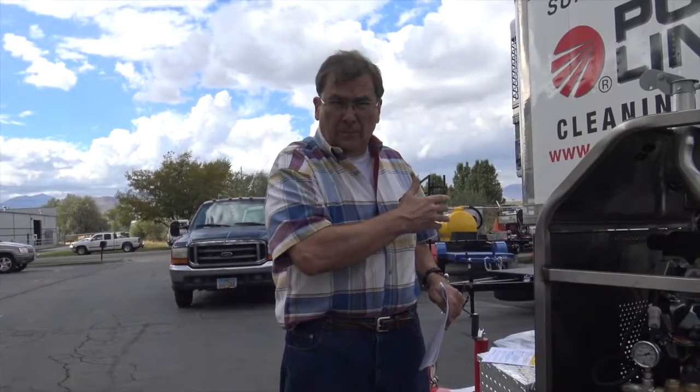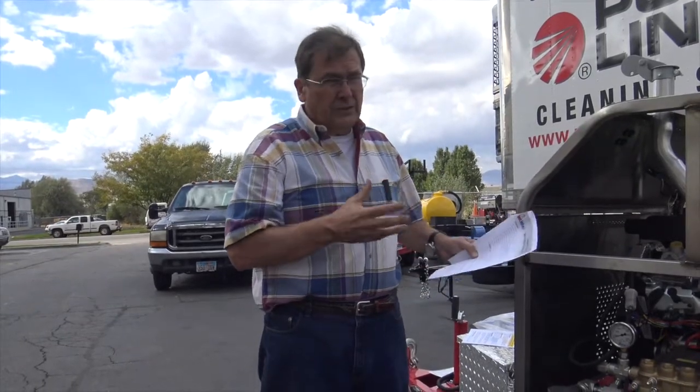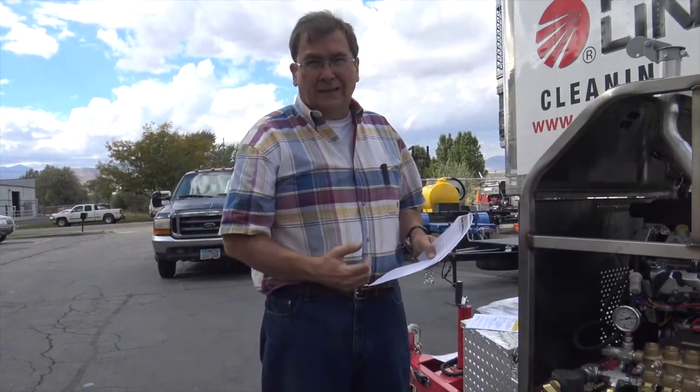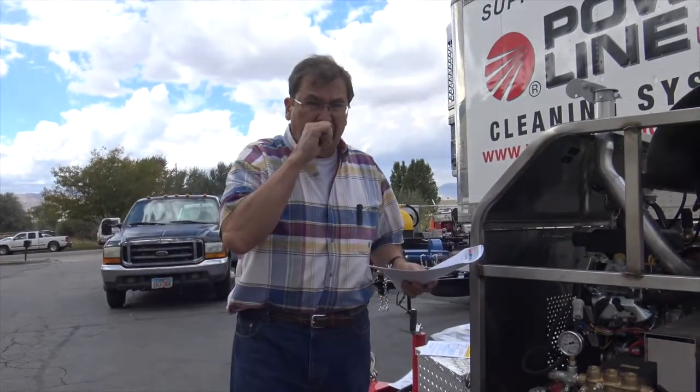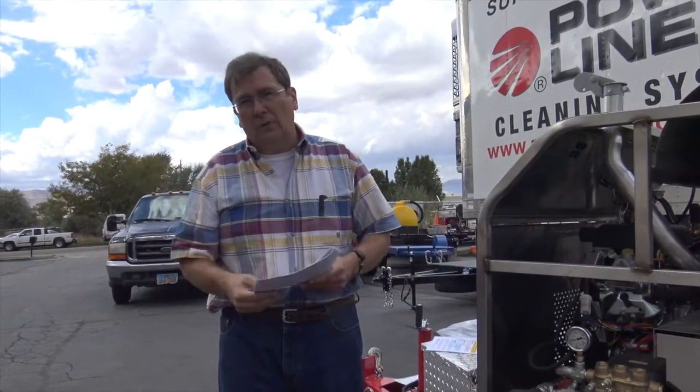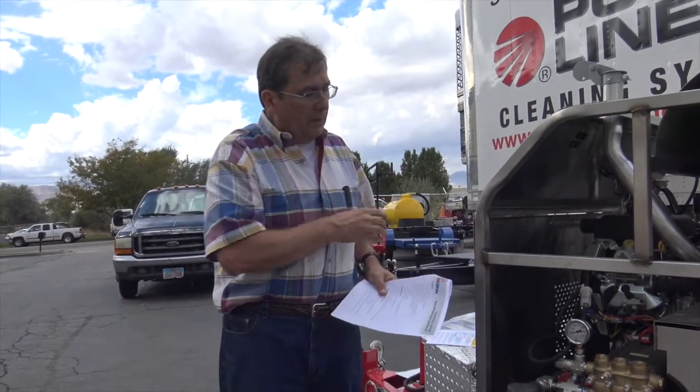It's got break-in oil. You have to change it between 5 and 10 hours, and I'd use Mobil 1. Hey, it's a Mobil 1 endorsement. I'd use Mobil 1, 100% synthetic. You know, Valvoline's good, Castrol, whatever, but we love Mobil 1.